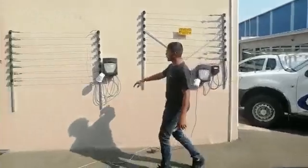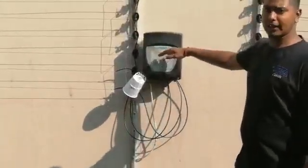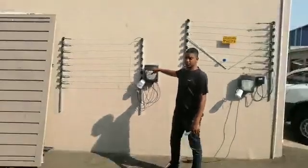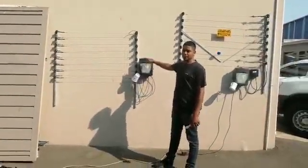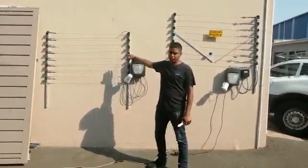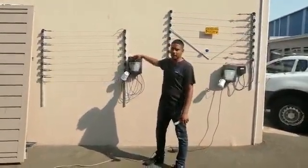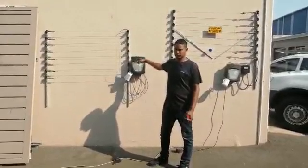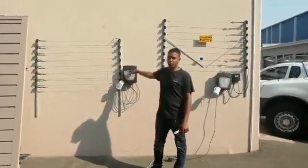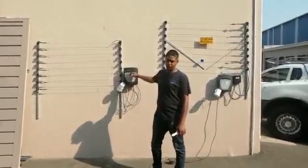On this fence here you can see there's a Wizard 4 energizer fitted. Some guys actually put a smaller energizer that does 800 meters, but the connection which is in parallel is not effective. So you can get a cheaper price using a smaller energizer, but your fence is not actually secure. Just be sure when someone is quoting your electric fence that you ask them about the specs and dimensions of the energizer.